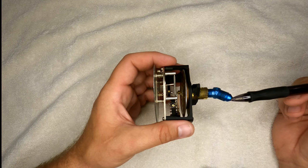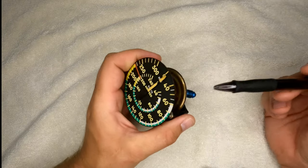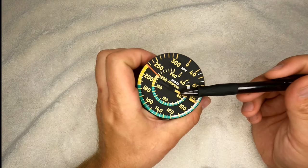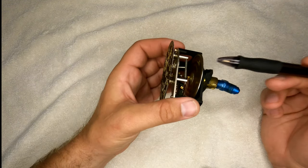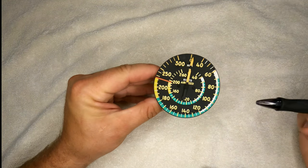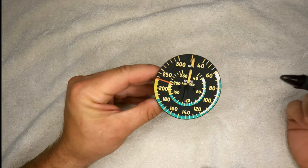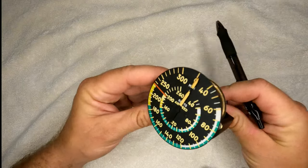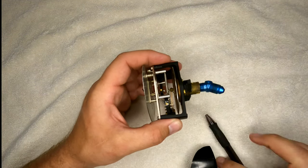What happens if both the pitot tube and the static port get clogged? Really, it's going to freeze your airspeed where it was when they got clogged, because you'll keep those ratios the same. That's a better explanation of how those pitot-static errors arise when you can actually see how this housing connects with the static port and the pitot tube connecting to this wafer.